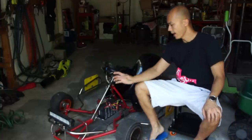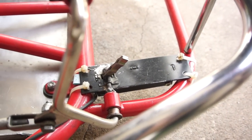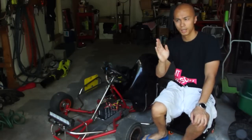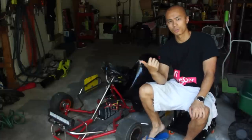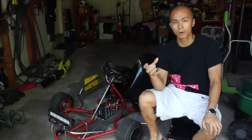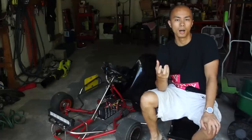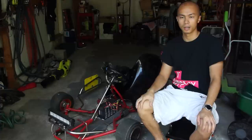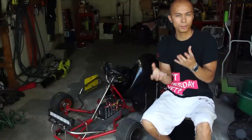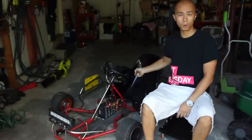The controller is controlled by a throttle — I'm using a throttle made for an electric golf cart, which I've welded onto the original throttle position of the go-kart. It uses a hall sensor that goes from zero to five volts depending on position, controlling the acceleration. One really cool thing about this particular controller is that it's current-controlled rather than speed-based, which gives you more refined control. You can ride at really slow speeds and still control it well, versus a speed-based controller which would be jerky.